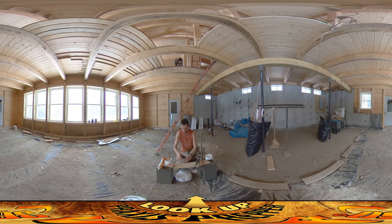I'm putting it in there and swirling it around. Now I'm going to check my plumb — plumb is a word in carpentry that means straight up and down, it's the perpendicular version of level. I need to adjust my blocks just slightly, but that's me being really unreasonably accurate here — it really doesn't matter that much. I'm going to use a piece of duct tape just to secure it to this 2x4, which I have clamped to a couple of cinder blocks. I don't want to mess up my verticality while I do that.